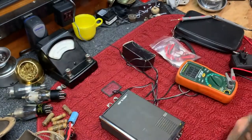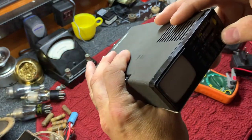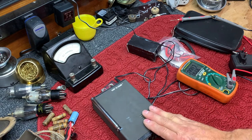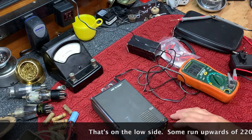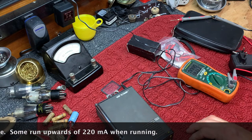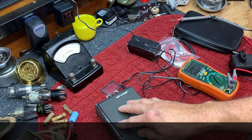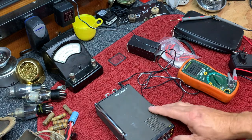Usually you don't see any raster at all on the tube, so I'm really tickled. When the set is running with a new set of batteries, it'll run about 120 to 150 milliamps with the screen on and audio set about halfway — that might help you troubleshoot. It charges at 50 milliamps, which is very low, but Sinclair claims they purposefully ran the charge at a slow rate to save the batteries and make them last longer.